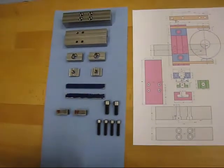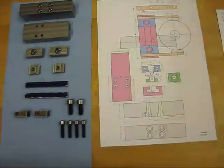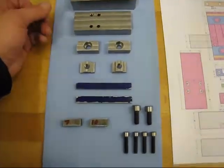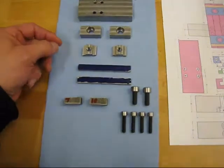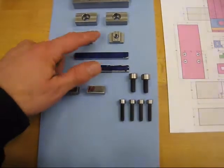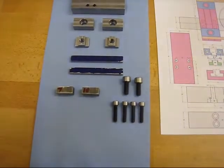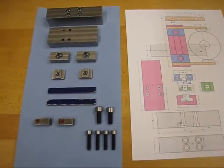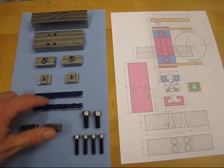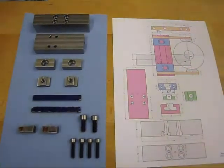There are a few revisions today — two millimeters cut down for clearance. This part is finished; that one needs to be tapped. Those need to be drilled and tapped from here to fasten these. The T-nuts are finished, and these bars just need to be drilled. Now I'm kind of stuck for tools after I've done these two, so it will probably be a week or two until I can continue.